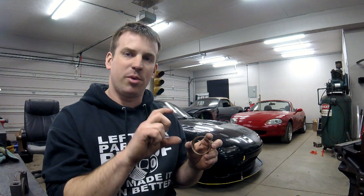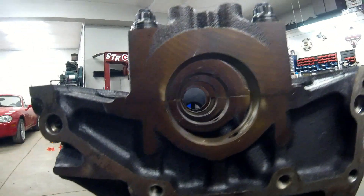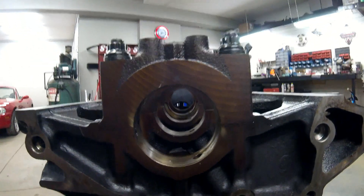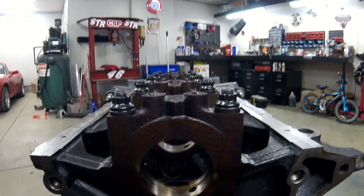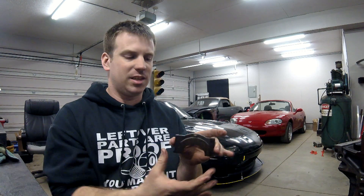There's not a lot of room for slop, so we need to put these bearings into the journal and maintain a perfect circle inside of it. The journal is made up of the bottom half of the block and then what they call a cap — you drop it into the block and tighten the bolts down. Logically, if my bolts are bigger and tougher — meaning they can't stretch — I'm going to have more resistance to this cap wanting to lift off of the block.